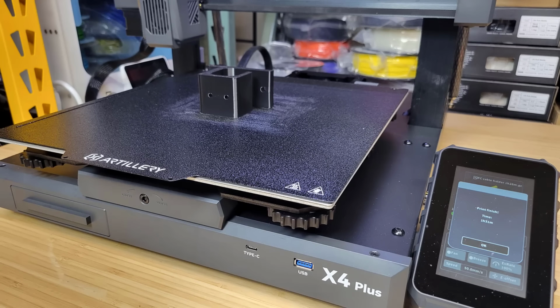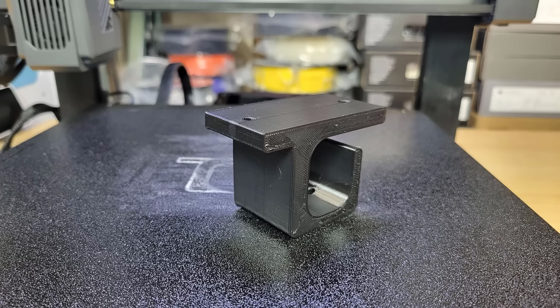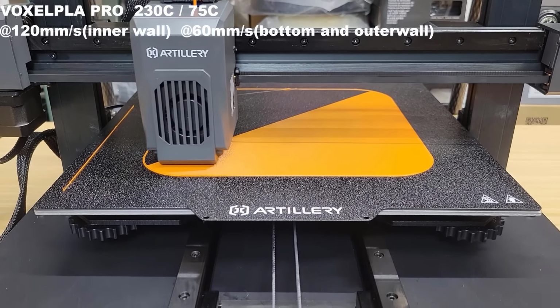The screw holes are overhanging with cooling off, so it's not as nice as PLA with strong cooling, but it's still capable of printing functional parts with polycarbonate with reasonable quality. Finally, I will print a taller trash can and see how this large bed slinger handles taller models.